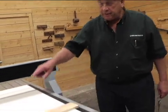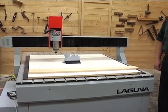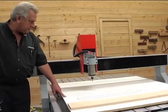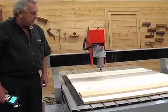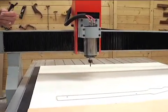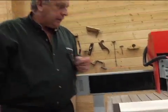We're finally out in the shop. This is the Laguna Swift CNC router — a 4 foot by 4 foot table with a 2 horsepower liquid-cooled electric spindle. This is what we're going to cut our guitar neck on. We normally run a dust collector with it, but I'm taking it out of the way so you can actually see the machining. I've already done some preliminary work: this is a spoil board where I've cut an outline so I know where the part will be, and I've attached the blank to the tabletop. We've got a quarter-inch ball nose ready, and we're going to do that dished-out surface in the headstock first.